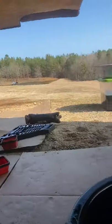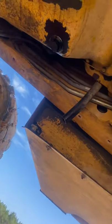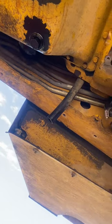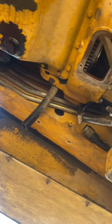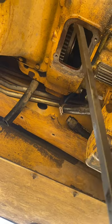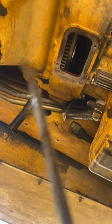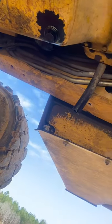I did take the flex bolts out — I've kind of done a lot of things in about 30 minutes. I just take a pry tool here and then turn the flywheel to get to these actual bolt locations. One's right here, and there's three other ones — four bolts in total.